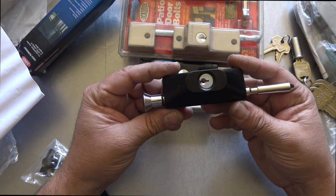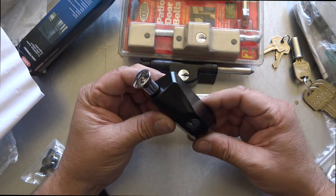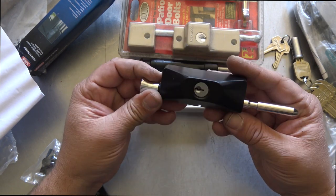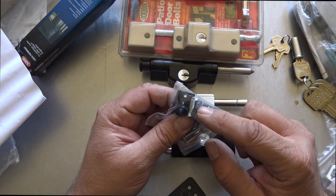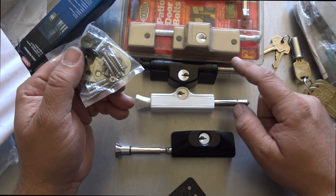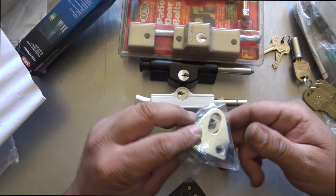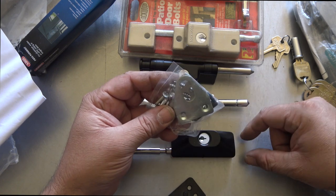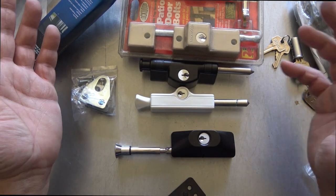The design is chunky and solid — you could even get away with using it on the front of an aluminium office door given its size compared to an 80i bolt, and it's front-fixing so it's a quick bolt to put on. It comes with a packer, screws — the self-tapping metal screws are a slightly bigger gauge than others, deliberately, so if you're replacing an old bolt in the same footprint you get a better bite. It also comes with two escutcheon or strike keepers — a large triangle one and a flat dress plate.